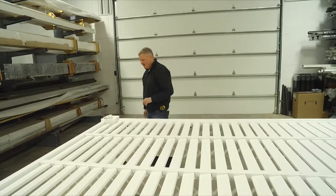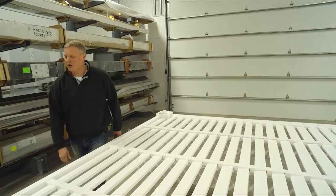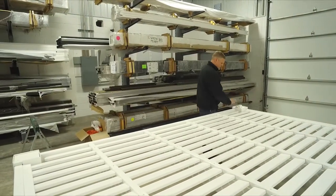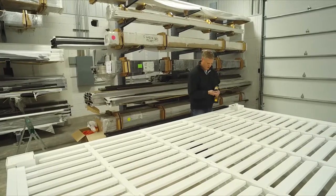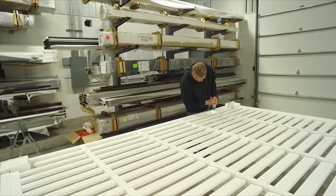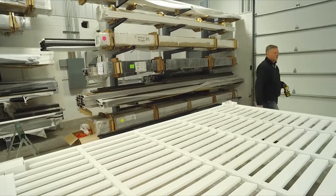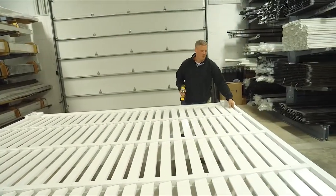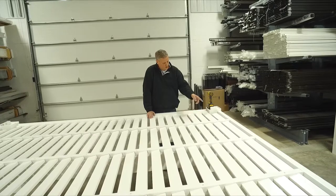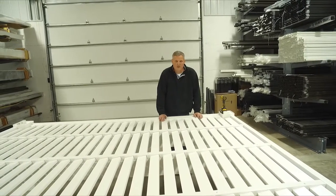Once that's all done, you're going to want to put fasteners in your last outside picket. You want to center this picket between the posts. It's helpful if you peel the stickers from the purlin holders before this step. Go ahead and screw that in down here. You'll do the same with the purlin at the other end and the same with this purlin here. At that point, all there's left to do is peel stickers, put a couple screws back in the rafter that we unscrewed, put a few plugs in the outside purlin holder, and clean off any marks.